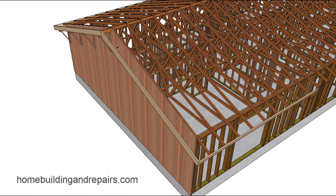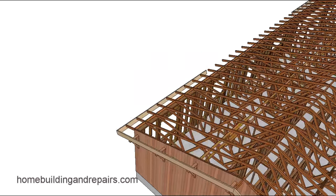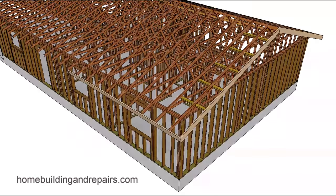If we just remove the siding supports or fascia board supports, we're not going to have a very strong eave or barge fascia board section. This will be weak and over time it could sag — you definitely wouldn't want to be walking up on that area hanging Christmas lights. Here's one suggestion.